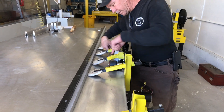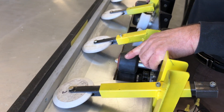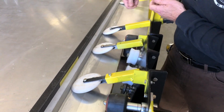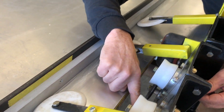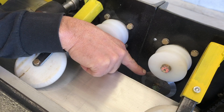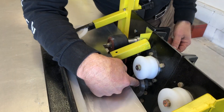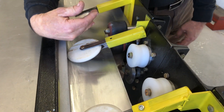There are four drive wheels — these are actually wheels off a skateboard that we've put inner tube over top of to give us grip. The skin comes in, this pinches it and drives it forward, and this one pinches and pulls it through. On the bottom of these wheels — which is very difficult to see — is what we refer to as the knife; that's the piece actually making the bend. We're striking the material twice: bending it about 10 degrees the first time and about 12 degrees on the second. This here is the die that the bend rides in as it comes through.